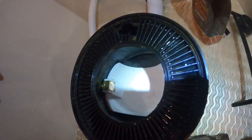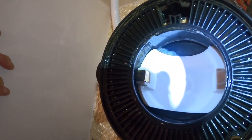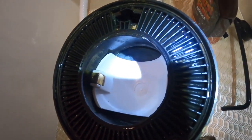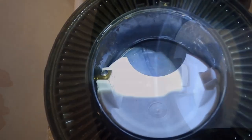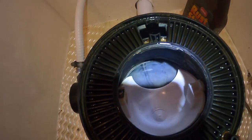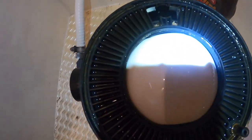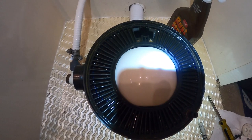We were able to get that shaft in — it took a little persuasion with a hammer and screwdriver. There are two rubber seals on that shaft, making it much stronger than the old plastic one. We hammered it in and got the screw into the slot on the left side. Don't overtighten since it's going into plastic — just make it snug so the shaft will turn. Now we need to rotate the ball to the open position, otherwise it won't rotate once the spring assembly is installed.